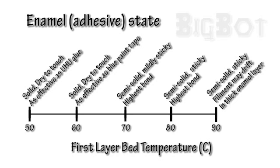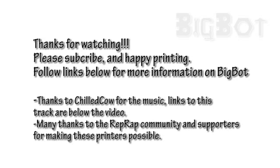Then turn the temp down to harden the enamel. For the highest adhesion, I use 75°C first layer bed temperature, 65°C print temperature, and always remove the part under 45°C. Often when I print with PLA, my bed temperature profile is 65, 45, 35°C. I will be making a follow-up to this video that attempts to explain warpage, show why turning bed temperature down after the first few layers makes sense, and why enclosures have relatively little impact on your print quality.